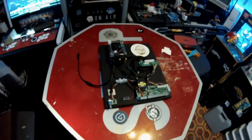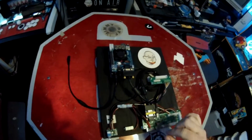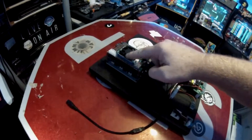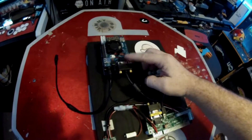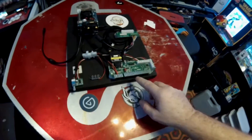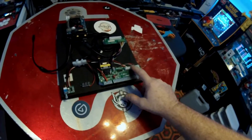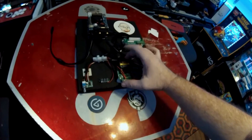All right, guys. Here's the basic setup. Up here we have the MiSTer FPGA, which is the DE10 Nano board. I do have the I/O board on it. I also have the MiSTer Add-ons hub and the 128 megabyte RAM module. How I have this set up is I have it going out of the VGA port into a JPAC. The JPAC basically takes your JAMMA edge and converts it — they're used for MAME — it converts to a USB input, kind of like any real USB encoder. So that's for video.